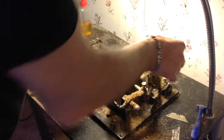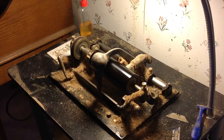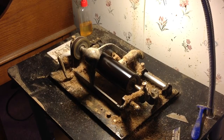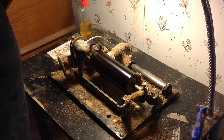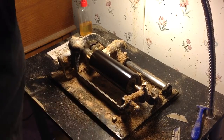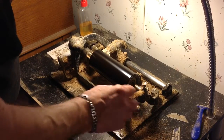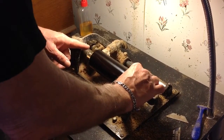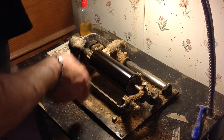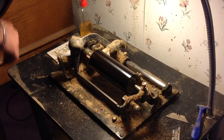Give it one more pass. So as you see, in less than five minutes we've gone from a useless artifact to a usable recording blank. This blank was a dollar, and it still has some mold in it, so a couple more passes on the shaver we can get all this out, clean up this edge, chop it off, turn it into a phonograph cylinder.